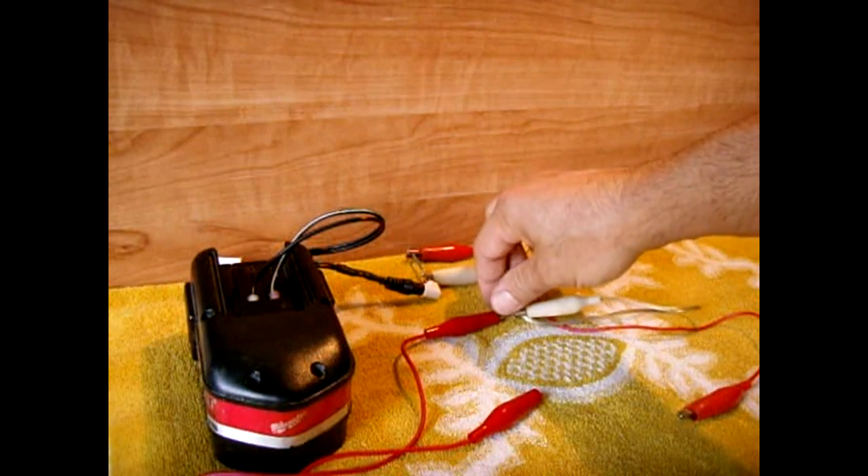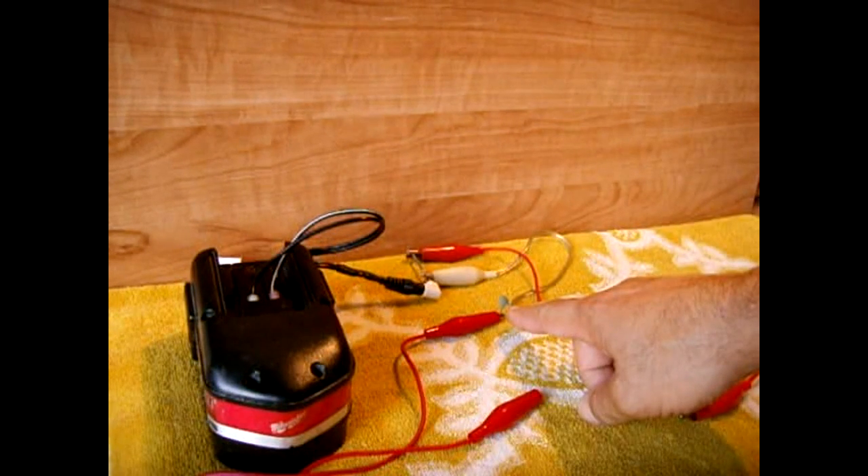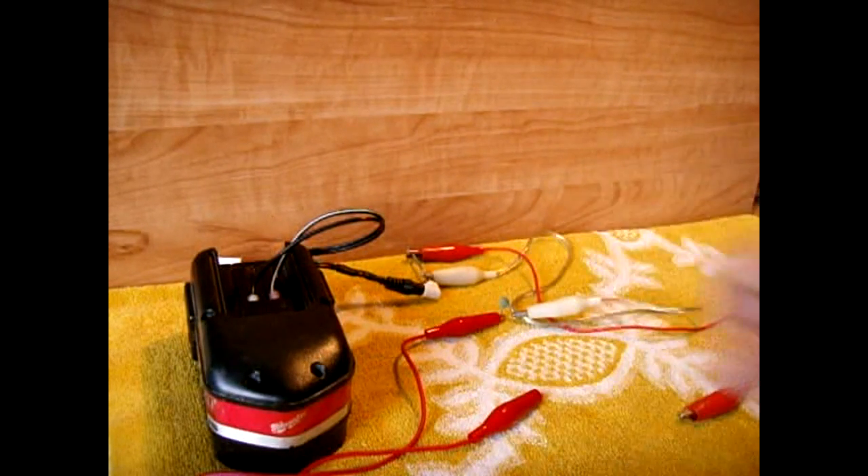The only flaw with these that I can think of is there is a delay period — you have to wait and let these cool off. If you have a circuit that's really dependent upon this inrush limiter and you power it on and off quickly, you could have a problem because you're not going to get the full effect of the current limiting unless this has cooled off. Usually you wait about a minute or two. If it's rated at five ohms and you turn it off and on quickly, you're only going to get maybe three-quarters of an ohm.